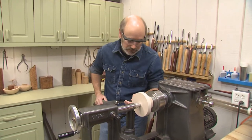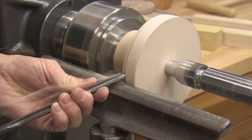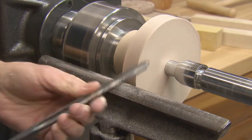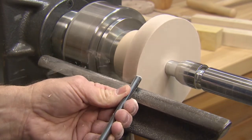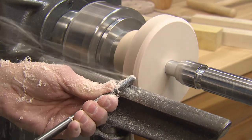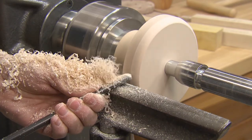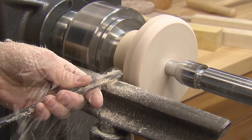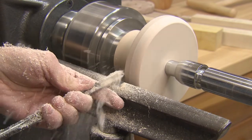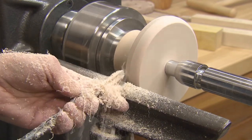Now we're going to true this up a little bit. I like this little bitty bowl gouge — it's really great for delicate work. I'm just taking a nice, clean cut across the face, not rushing it. Now we're rounded out. Now I want to come back and do a pull cut here and start rounding the wheel. I don't want this to be really flat looking. Now we are working with end grain here, so we're going to be leaving some tool marks. This pull cut is pretty cool because you can't do a push cut on this because the tailstock and the headstock would be in the way. So by doing a pull cut I can also do this side before I turn the wheel around.